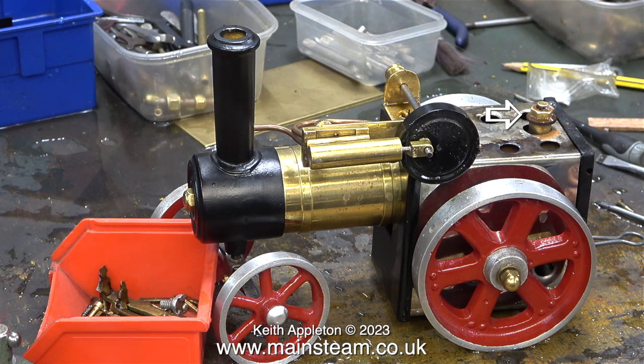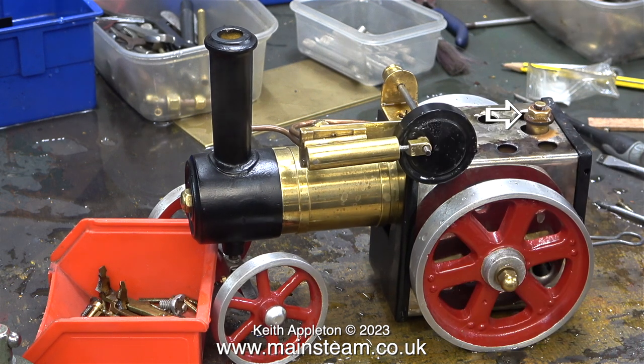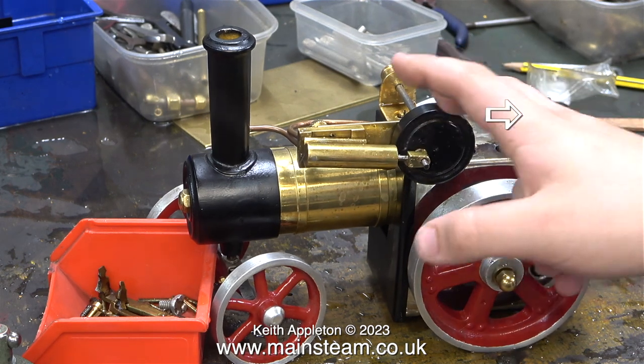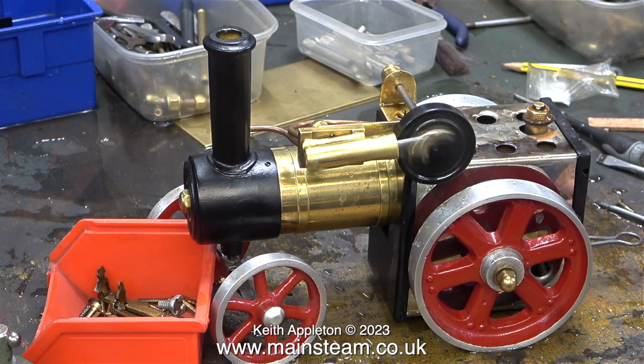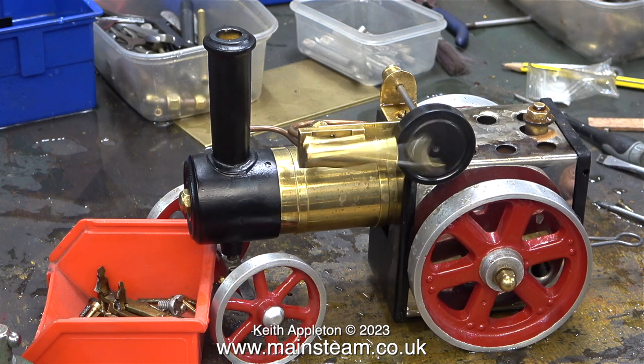Keith, your face says it all. I was looking at the amount of water escaping from the safety valve — the O-ring around it was very perished, and I gave James another one but he didn't fit it, and when he left it was still on the bench. The water escaping from the safety valve and running down into the burner area cooled the boiler. That's the best it's ever run — it's running okay now because the safety valve has stopped releasing copious amounts of water down into the burner. The water mixes with the methylated spirit and dilutes it so it doesn't burn quite so hot. Here's a slow-motion run.